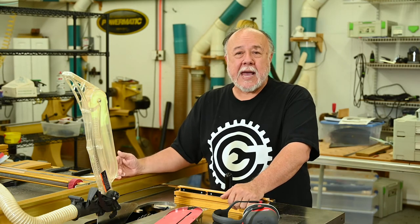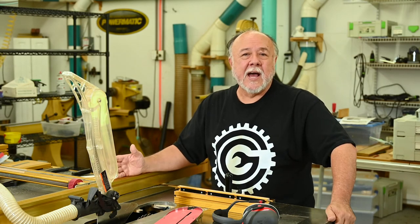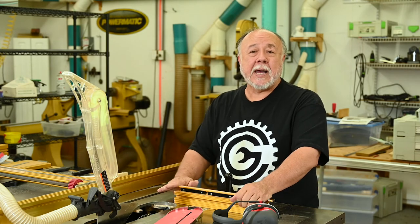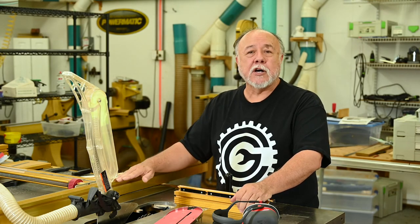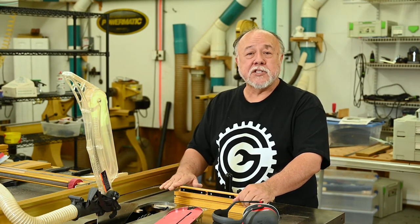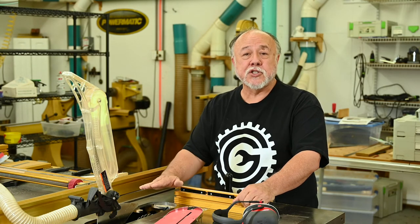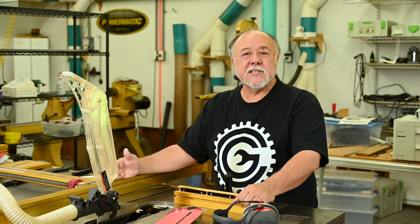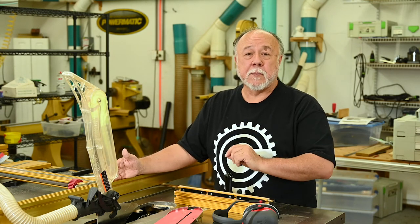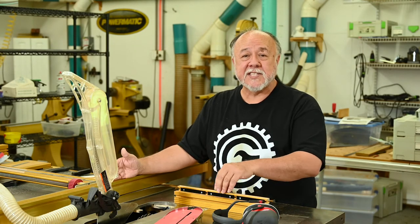I like it. I advocate it. If you don't want it, that's up to you. That's it for today — I just wanted to make a quick video showing you guys how I, more or less, screwed up and cost myself $300. If you're a SawStop owner, be aware of this issue. We all know about not letting metal fences touch the blade, but in this case it was a metal fence getting too close to a blade and a deflection problem — I never thought about the blade deflecting and hitting the fence.